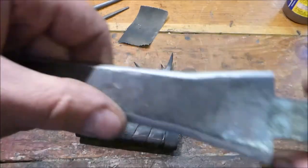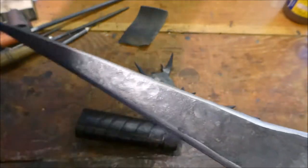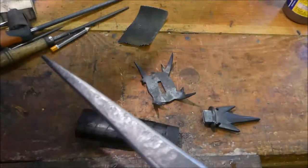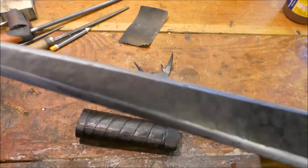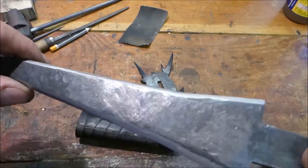I've taken the blade, heated it with a blowtorch, and then hammered it. This creates oxide on the surface so it gets a nice old look. Then I've just gone and filed the edge to bring it up.